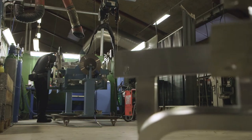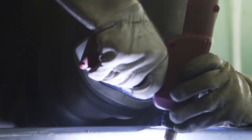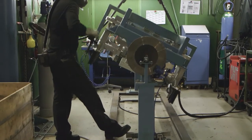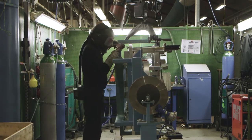The first step sees the golf car start out life as several chassis parts, which are made from bent and extruded pieces of metal. A welder takes each part in order and places them onto a jig, which holds the parts completely still whilst allowing the chassis to rotate. This means every weld location is easy to access, which makes sure all the welds are of high quality.